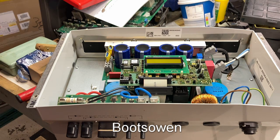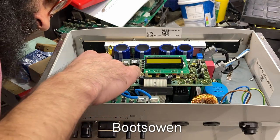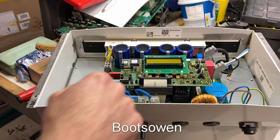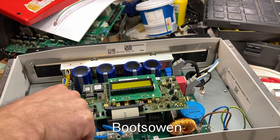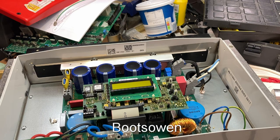There's a massive fuse over here on the DC side. Power coming in — quite strange. The power's going to this board here, and I hope this thing doesn't have some kind of optimizer system going on, because that would be annoying. There's certainly some kind of a weird thing going on here with this board up on top. It's a DC power-in board and it seems to be doing something to the negative side. The positive side comes straight into the board below but the negative is going through these blues. So I can drop a spade connector in from my DC setup.